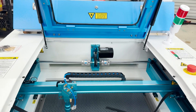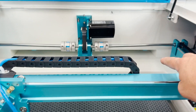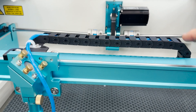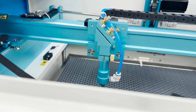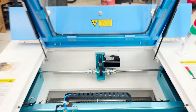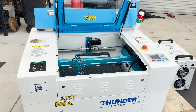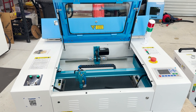One of the things I can tell I'm going to have to do — probably hard to tell on video — but the motor and the rails for the left and right drive belts for the gantry system are bowed in, so that's going to have to be adjusted. It likely dropped down when it was flipped. We took the belt tensioners off and I'm going to put those back on. Other than that, we're going to do the bare minimum just to show you that these things can take a beating and keep on going without much of an issue. Let's start by reconnecting the belt, firing it up, and making sure we have good motion out of all axes.